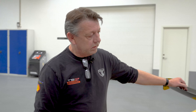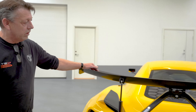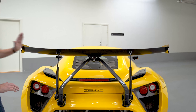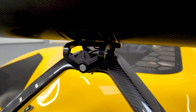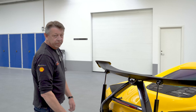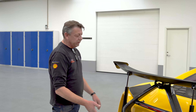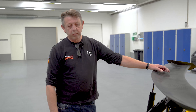Just very short functional principles: when the wing tilts, you're entering a corner trying to move the weight of the car. When we are pushing the car sidewards, as high as this pivot point here, the wing will act like an anti-roll bar, forcing the inner wheel to give you more grip. This is what you want in a supercar where the engine is placed in the rear — they have this tendency of losing the rear end, so pushing it inside gives more grip on the inside wheel. That's what the wing is made for.